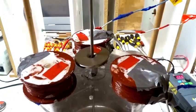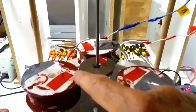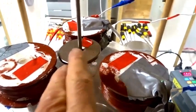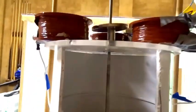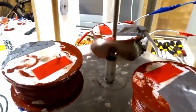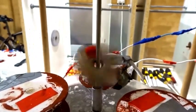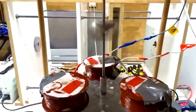Finally, let us remind everyone that the 60 millimeter magnet can rise even further straight up if we put it on the top. We have three coils UVW, variable frequency device. We've separated the coils enough so the 60 millimeter magnet can wobble around on top, and now we have absolutely nothing below — just empty space. You remember it rose up from below. Now when we turn on the three-phase power it again wobbles, and as we increase the three-phase frequency, it again rises up.